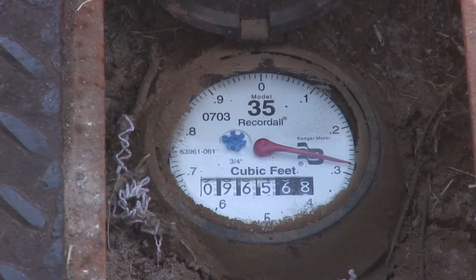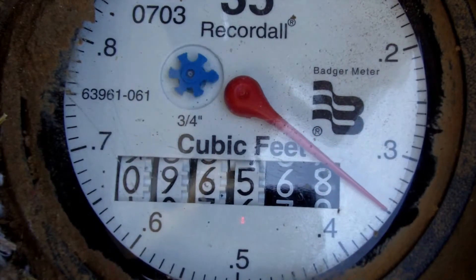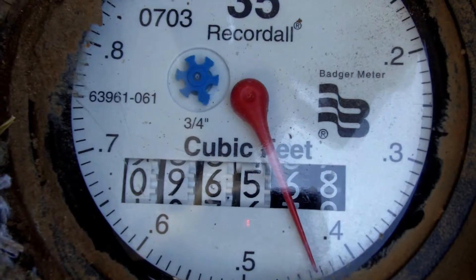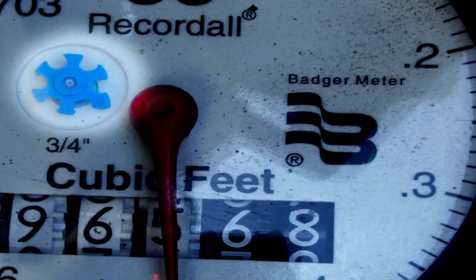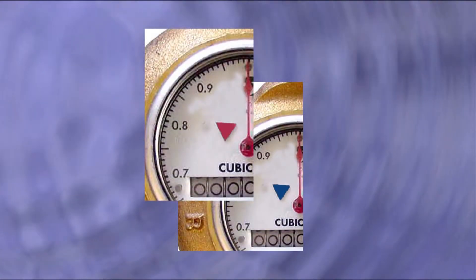So you lift the lid and wipe off any dirt or debris on the face of the meter, and now you can see the complete meter face. Let's look at the larger red hand first. It sweeps around like a clock and measures how much water you're paying for. As the hand moves, usage is tracked by rolling discs with numbers, much like the odometer on your car. See the blue asterisk in the upper left-hand corner of your screen? That's the leak indicator.